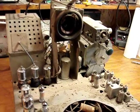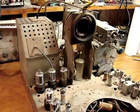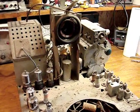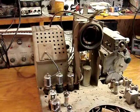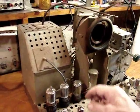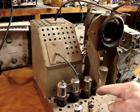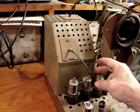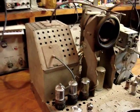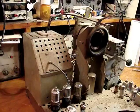One thing I do know is the set does receive. It was noisy, but it actually worked enough to where I could receive my channel 3 transmitting channel into it. So I know that. Here's an issue. Here's the 6BQ6 horizontal output tubes. Now I had both of these tubes out and tested them, and they were absolutely fine. But this one, the cap came loose when I put it back in. So I have to deal with that. I hope I don't have to replace it.